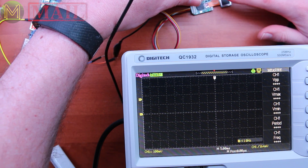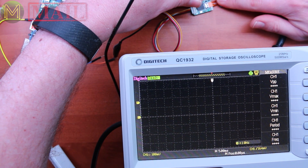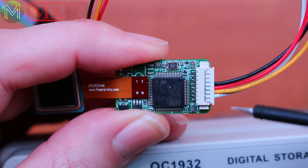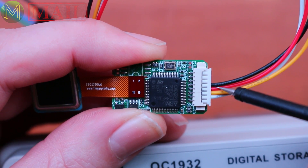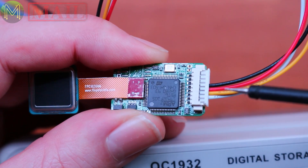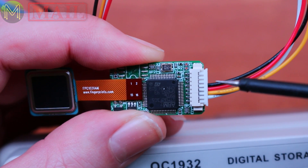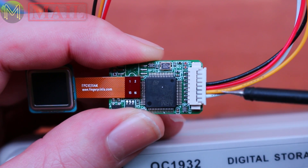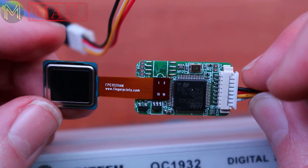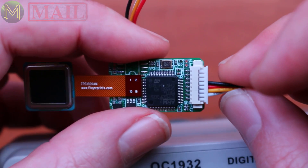I'm just putting my finger on the sensor and I should see something coming out. I'm not really getting anything. I think I've completely buggered this STM32 up. According to their diagram, it goes ground, RX, TX, VCC. But according to buzzing it out, this is ground and that's VCC. Just a word of caution — if you're coming across a board you're a bit dubious about and you don't know the connections, buzz it out first. Don't just connect everything up. It's a real shame because had I buzzed it out properly I would have realised VCC and ground were around the wrong way. I might have some time this week to have another look at it and review it again in another Mick Make Mail.